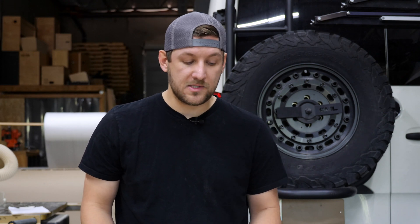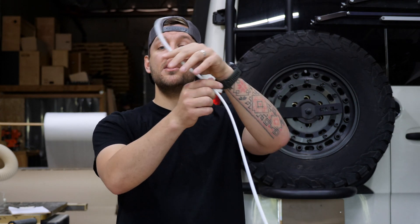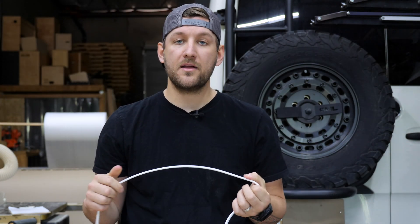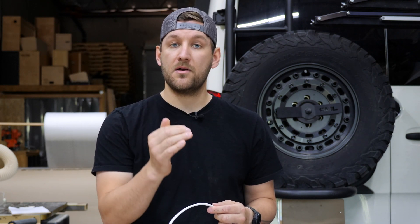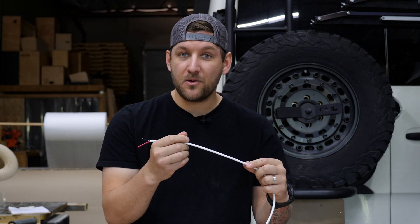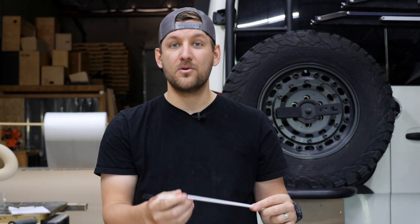The second form of redundancy is going to be protecting your cables. If you've ever taken your wall off in your house or been in your attic, you've probably seen a lot of white cables floating around. In a house it's probably fine because houses generally don't move — but a van moves, and a van moves a lot. Most of what you're rubbing up against is bare metal or metal with a very thin layer of paint. Rubber insulated wire against metal — the rubber is going to lose. It's going to vibrate and eat through that outer insulating layer, causing problems — maybe not immediately, maybe not a year down the road, but eventually you're going to have issues.